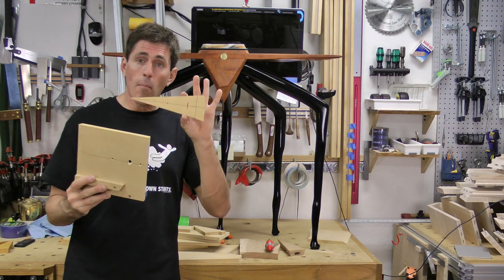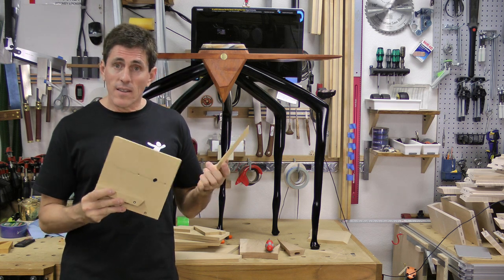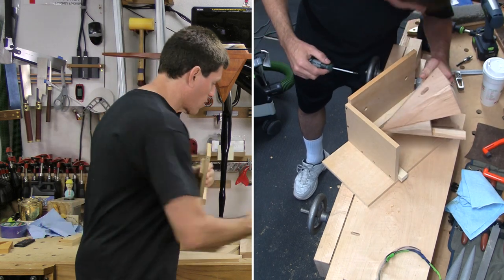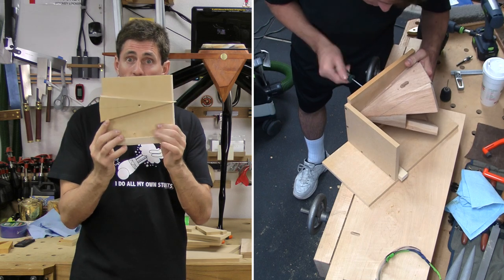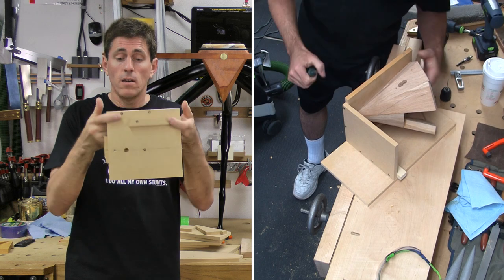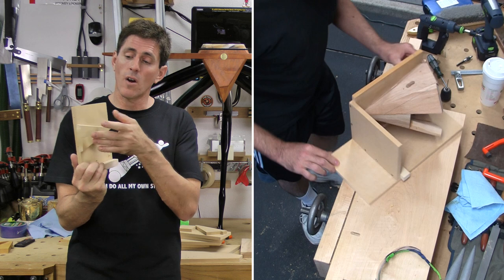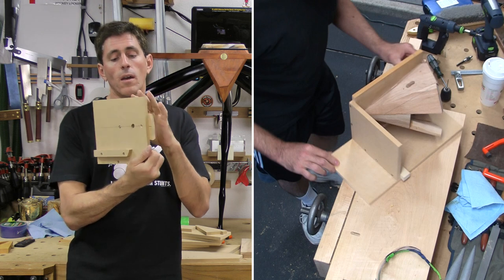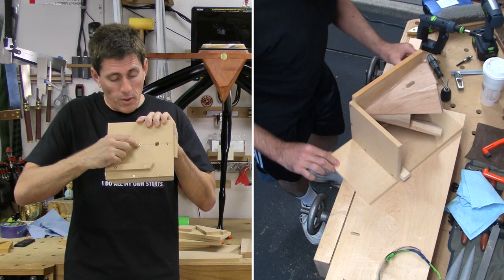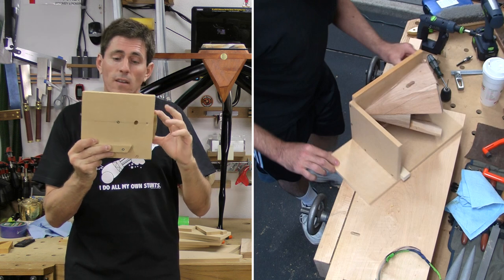Now what I did is then I mounted the octagon that was assembled, and of course I only have one piece here to show, on the inside of the jig. So when I put this thing here and I screw it in, it would be attached like this to the back. But of course, with that one screw through from the one side, it's able to pivot. Now, what I did is, because there was a center line drawn on the front facet of the octagon, and there's a center line that I drew here, right? A line that I drew off the bottom that's parallel, but then I put a screw right through the center line, I'm able to rotate this octagon back here.